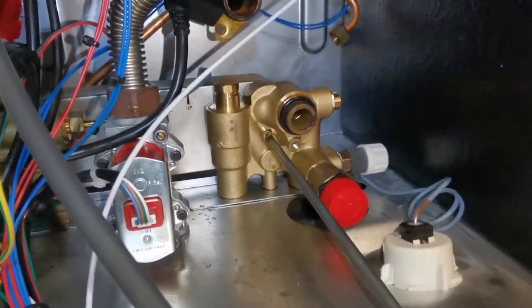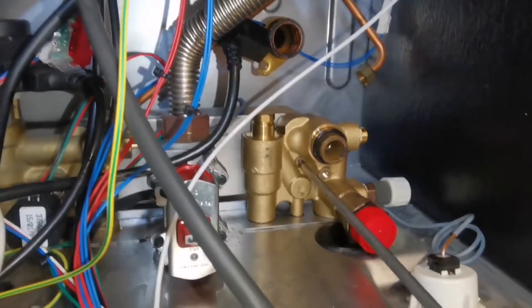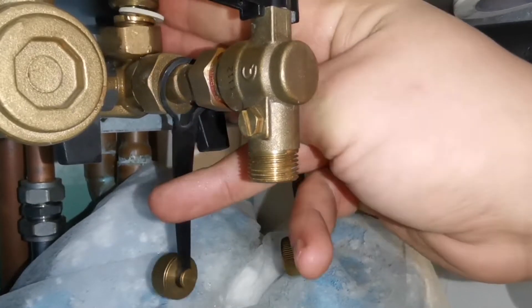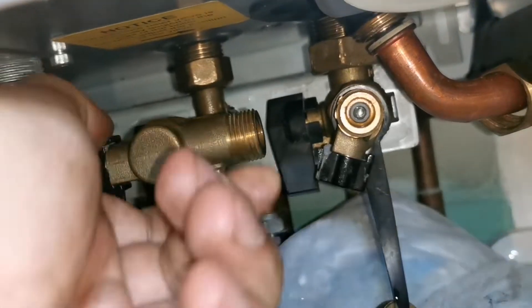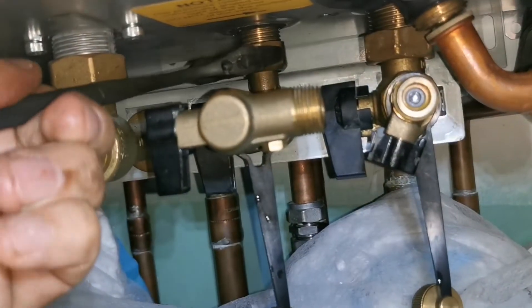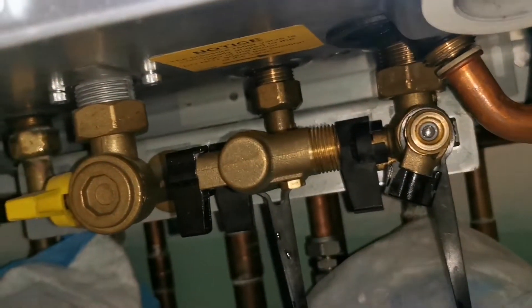So there we go — I'll demonstrate it because I'm moving the camera from one hand to the other and it's still not falling out. Silicone grease is the trick for when you're getting into those odd spaces with a screw. Then obviously with everything that has water, you've got to replace the fiber washers. Don't reuse anything unless it's gas — you can reuse gas washers, but if it's water just replace them. It's not worth it, not worth the hassle.